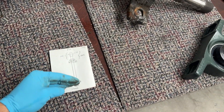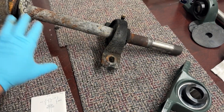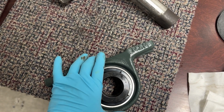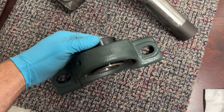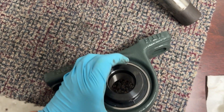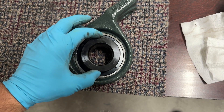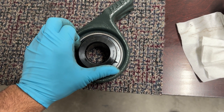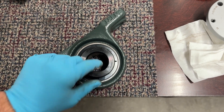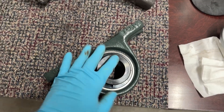It's a good idea to draw everything out and take measurements before you go tearing stuff apart. Now these bearings here — this is the way that they lock on. So you've got that hex screw, but then this is kind of like an eccentric design. When you take a punch and hit this ring, it locks that bearing in because it shifts this ring off from the main bearing race.